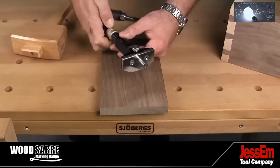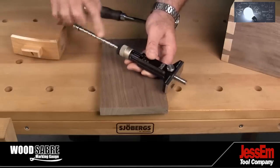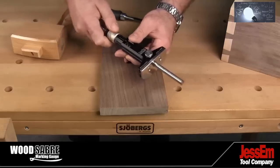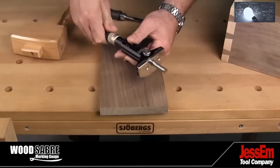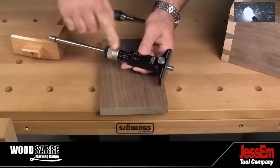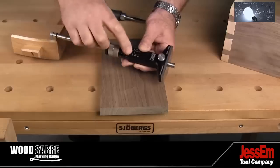The blade is made of A2 tool steel and is hardened to 60 Rockwell and is honed before it leaves our factory. You'll notice the guide shaft has grooves cut at 1/2 inch intervals, and the shaft has clearly etched lines to know the position of your blade. A spring-loaded ball bearing snaps into the grooves in the shaft at 1/2 inch intervals. The blade can then be adjusted by rotating the spindle, which advances the blade 1/16 of an inch per revolution.